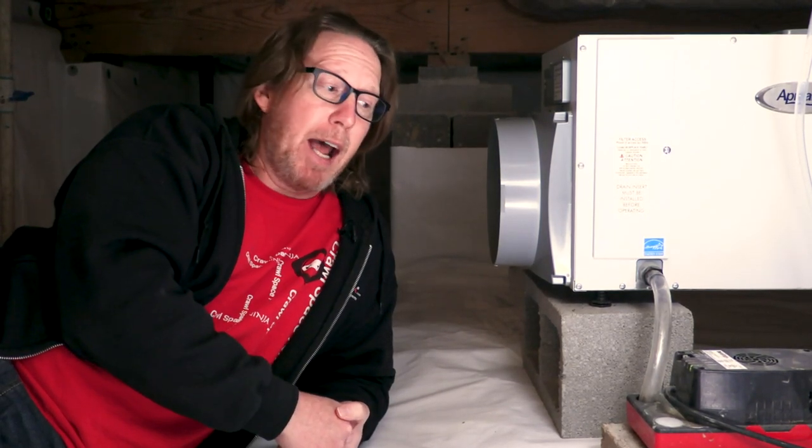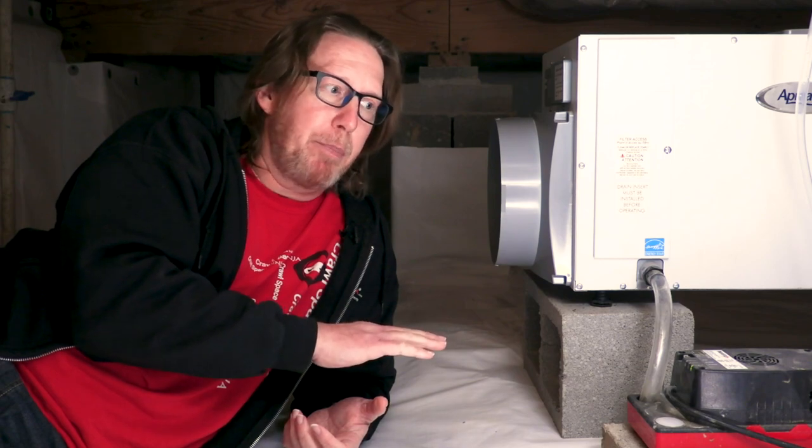So Hue Music Lab, I would recommend you have two separate condensate pumps in order to make sure they can handle the demand of both of those units individually. I would always put a separate condensate pump even if you have multiple HVAC systems together — if you have an upper and a lower floor HVAC together, you always want them on their own separate condensate pumps.